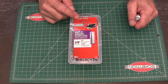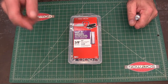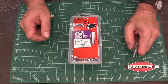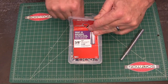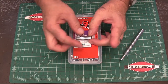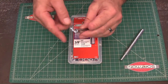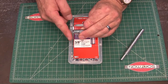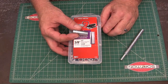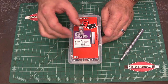I wanted to take a second to talk about these redhead anchors. These are really great anchors, they work really well. The nice thing about them is when you put them in a floor, you can have them flush with the floor. So if you've got a piece of equipment that you want to mount and take up, you're not going to be tripping over the anchors, because a lot of anchors have a little bolt that sticks out.